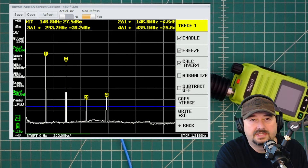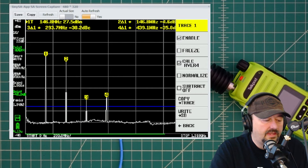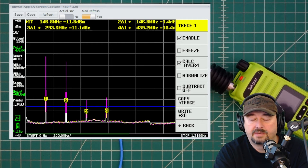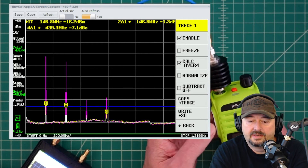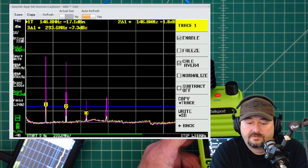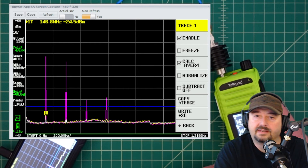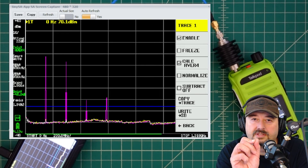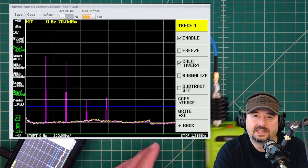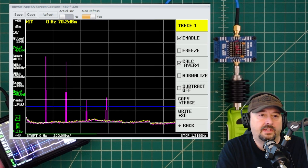You can see the color has changed — that is the measurement we took when we froze and copied to another trace. I go back to my radio: it's on 146.52 MHz. I move the frequency over just a little bit to 147.888 MHz — it doesn't matter too much — just so we can compare the original readings to the new readings. Then I go ahead and get the low-pass filter placed in line.